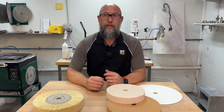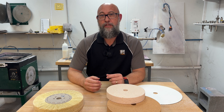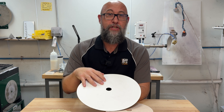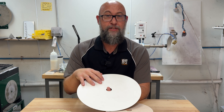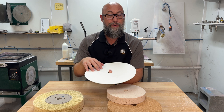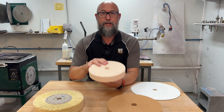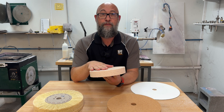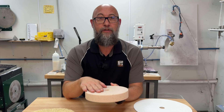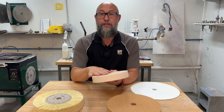For flat lap use with pumice, you don't see it as much, but it is possible and it works really quite well. Today I'm going to show you how to use a regular synthetic felt pad and pumice to achieve a nice pre-polished finish on the glass that's really going to cut down on my cerium time. This is just a synthetic felt material, non-perforated and solid — it works a little bit better with the pumice than perforated materials. You can also get Pulper's MJ material in larger pieces that will fit onto a flat lap, and they work fantastic for cleaning up flat surfaces with pumice.